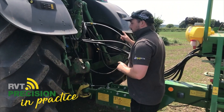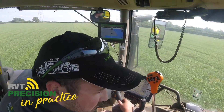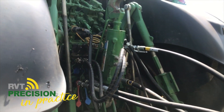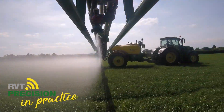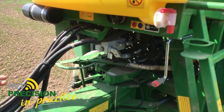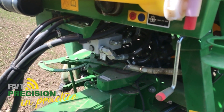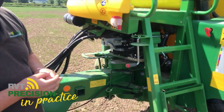All the Isobus is integrated into the tractor itself, and I want to get in the cab later on — we'll talk a bit more about that. Working our way back to the front of the sprayer, it's equipped with a 280 litre hydraulic piston diaphragm pump. You can also spec it with a PTO shaft, but hydraulic seems to be the future and a bit safer than the PTO guard. It has outputs of 280 litres a minute.